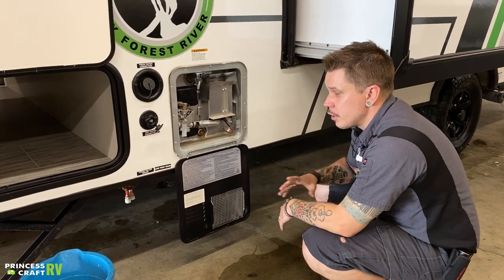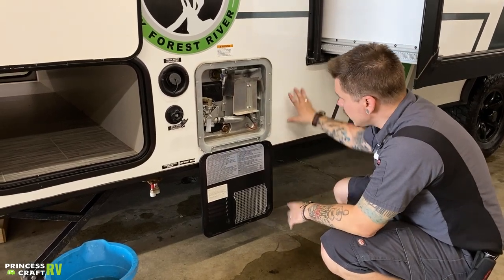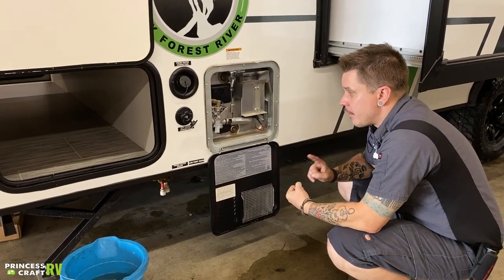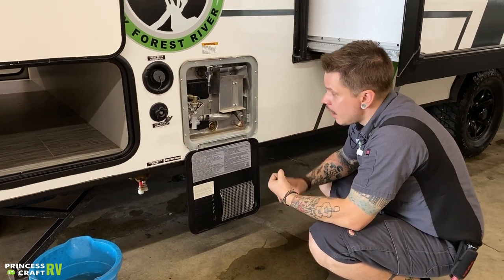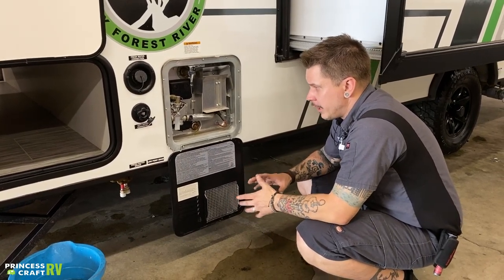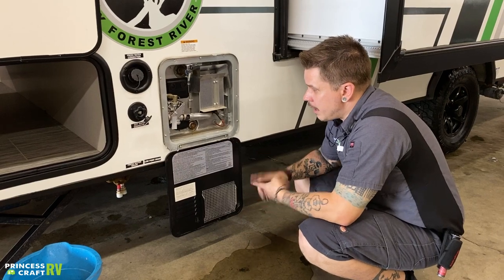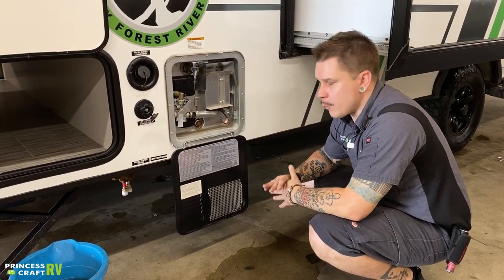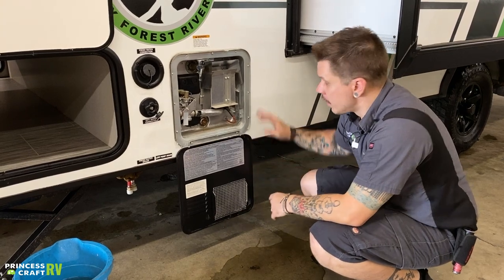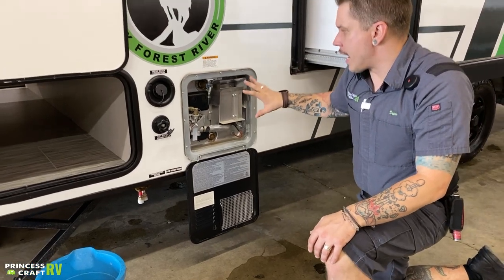To finish up that draining procedure and make the unit ready for storage, we're going to finish up with your water heater here. This is a six-gallon capacity dual-source water heater. You can run it either on standalone 110-volt electricity or propane gas with 12-volt direct spark ignition. The manufacturer has a couple of specific recommendations: number one, drain the unit if it is going to be in storage for more than seven days. When it does come to draining it, it's very important from a safety standpoint that we follow these directions to a T — that's going to keep you from injuring yourself, scalding yourself, things like that. Number one: give the water heater ample time to cool down, at least two or three hours.